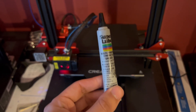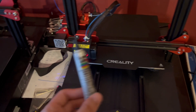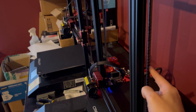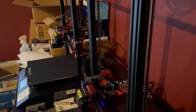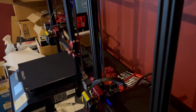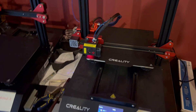Another thing you can do is buy this Super Lube multi-purpose synthetic grease. I use it for greasing my printers — your printers have these giant lead screws, and every so often, maybe once every two months, I'll wipe these down with isopropyl alcohol and then re-grease them. Maintenance like this will keep your printer in tip-top shape and give you excellent prints.